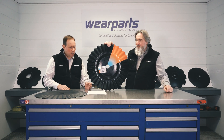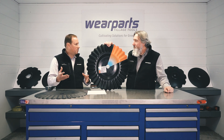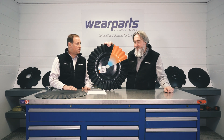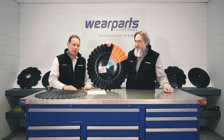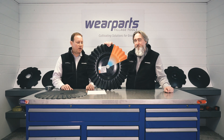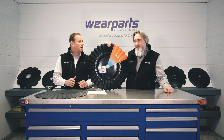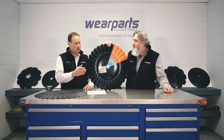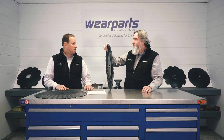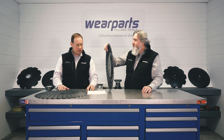Some people worry about that harder edge — is it more brittle, will it crack and break more — but we've found it actually performs better in rocky conditions and it wears sharper as well. It actually facilitates what you're trying to do with this DRZ blade, which is sizing residue and some tillage. You've got a little bit of concavity on all of our DRZ blades, so you're throwing a little bit of dirt, getting some black mixed in, but also sizing your residue.